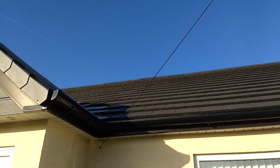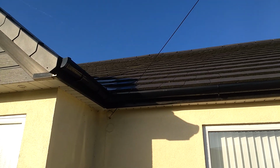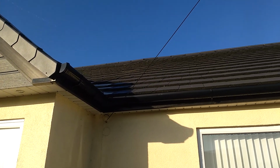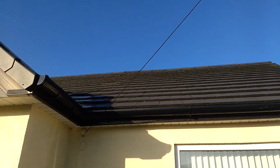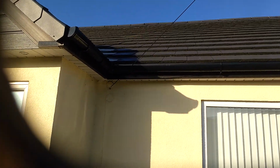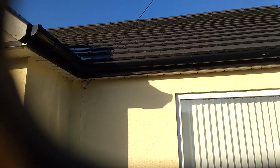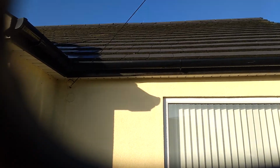In places, the tiles are very tight. And you can see just here that they've been put into a tight space and they're kicking slightly. There's a few instances of this on the back as well, particularly up here at the top on the opposite side, where the tiles are kicking and they're a bit tight. I think we've got a small peak in the roof just here. I suspect that's where an original gable wall was, and this is where the house was extended here, so I don't think that's anything to be concerned about.